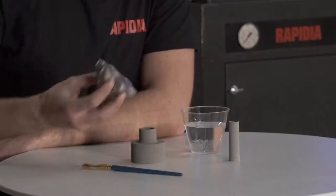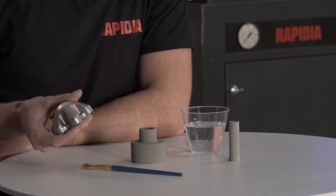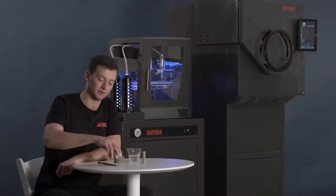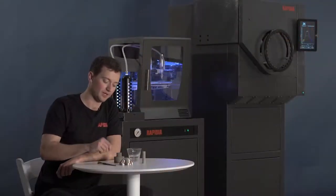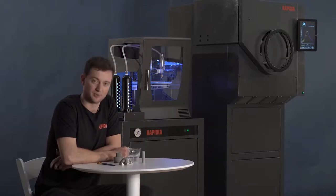For example, this part from a Stirling engine was printed as three separate parts without support, which were then bonded together before it was sintered. These water bonded joints are identical to the rest of the part after sintering because water is the base solvent in the printed material.